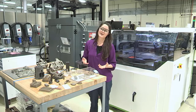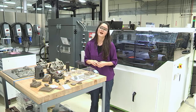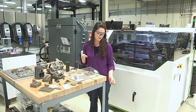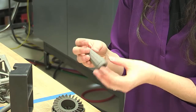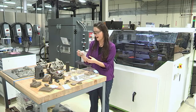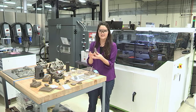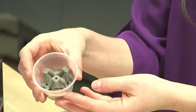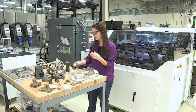Glued-together metal powder isn't very useful, so the last process we have is sintering. We heat the print up to its sintering temperature — that's when the particles are hot enough to stick but don't flow; we're not melting. Then we get a part that's about 60% dense, because of the packing factor of our particles. We are working on getting single alloy materials that are fully dense, but in this case, if we do want a fully dense metal structure, we can put some bronze in the furnace process. That bronze will melt at a lower temperature and wick up into the part using capillary forces. This is an example of that — we've got some bronze in with the part itself, and when it's done it'll be 100% dense, just like this part.